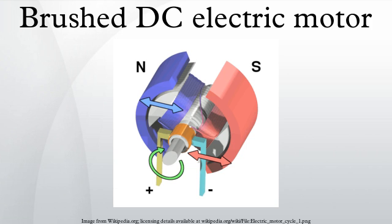Torque and speed of a DC motor. A DC motor's speed and torque characteristics vary according to 3 different magnetization sources: separately excited field, self-excited field or permanent field, which are used selectively to control the motor over the mechanical loads range. Self-excited field motors can be series, shunt, or compound wound connected to the armature.